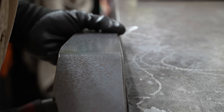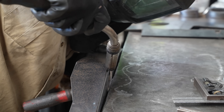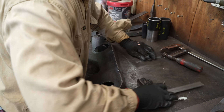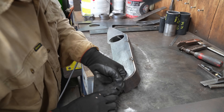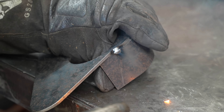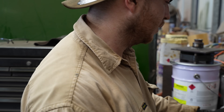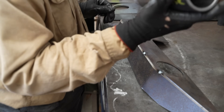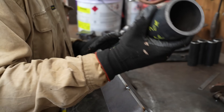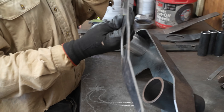Corner to corner — yeah, as much as we can. Joining two pieces corner to corner like this maximizes the amount of weld surface area. To put these together we've got to make sure they're lined up perfect so the shafts are in line and they're not slightly out or anything. So I've just made these temporary ones up. This one here goes in the back — I've had to turn it down so it fits in nice and snug. I've also got one here. This is the one that we've had to bend.